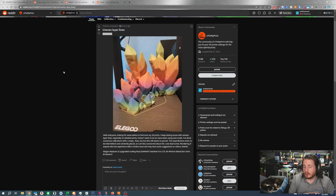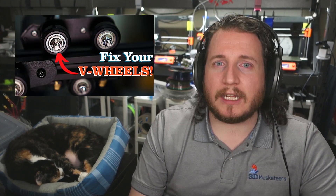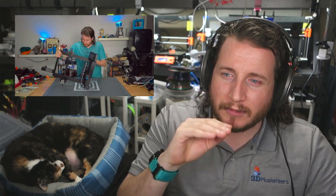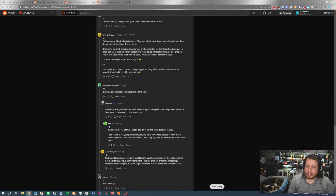I would guess we've got some wiggling going on in the machine — maybe not explicitly the lead screw, but we should be checking those V-wheels to make sure they're okay. Over time, V-wheels can loosen up as they wear in or simply come loose. Just like when you deal with ball bearing systems like LM8UUs or MGN12s — different types of linear guide rails — you need to keep those properly lubricated and greased. Similarly with V-wheels, make sure they're tight. We did an old video on this where we tightened up V-wheels to get machines running in tip-top shape.